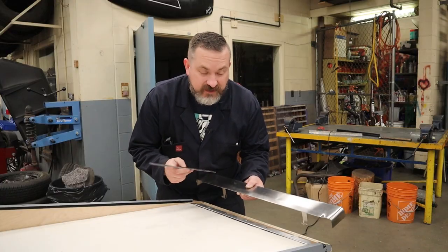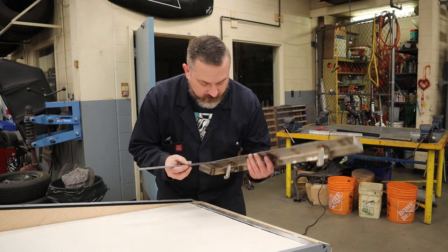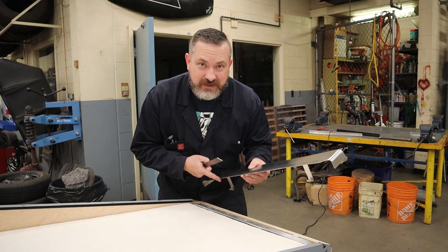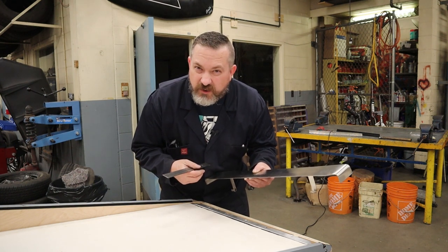Now at this end, underneath the lockdown bar, it's obvious that the glass can't go past the J-hooks, so basically just take a ruler and measure to the front edge of your lockdown bar, and I would not make it size to size, right? You're not going to be able to cut down tempered glass after, so maybe give yourself about 1/4 inch space.